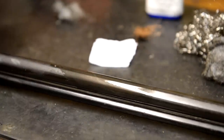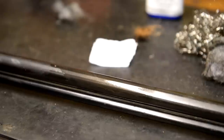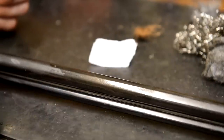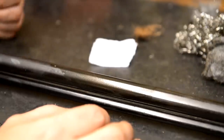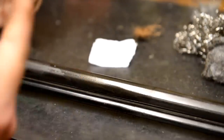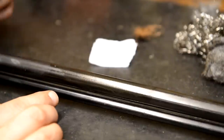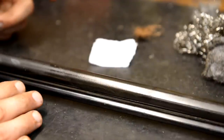We're going to allow both of those to sit just a little while. Then we're going to rinse off with some cold water and follow up with a little bit of oil and a patch — and that's generally about it. The cold water will neutralize this cold blue solution. Cold bluing is really just a form of controlled rusting. If you don't neutralize it, it's going to make ugly splotches on the barrel and they'll be really hard to get rid of. So I'm going to walk over to the ultrasonic — I've got some hot water and Simple Green in it — and rinse these off. Then we're going to follow up with a little bit of oil and see how well both of those products covered.